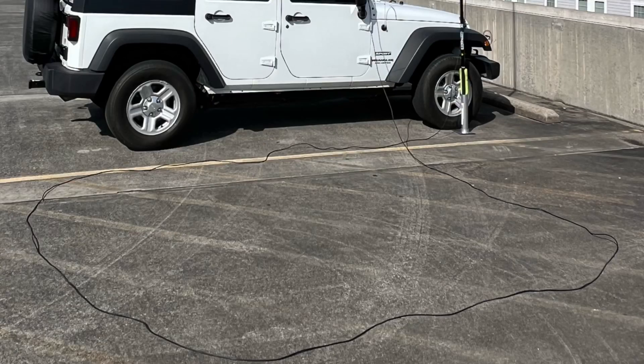You will notice — even I've used coax as a counterpoise, put one down. You'll get out and you'll work, and you'll do better with more radials. But I don't think the juice is really worth the squeeze as far as worrying about it and trying to make this perfect. Just get something done.